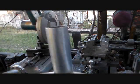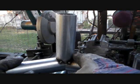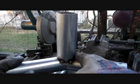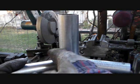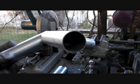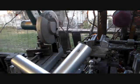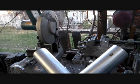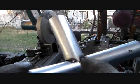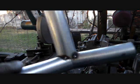Again, you want to get in there. Usually I'll put a magnetic square, a T-square, an angle square on the side, and then I'll just put a T-square over here and get it flush. You want it 90 degrees on both sides so that it'll be straight. And I'm using 12-inch sections of pipe. Everything else I cut at 6 inches, but I cut the 12s in half to make the corners and to make the crowns.